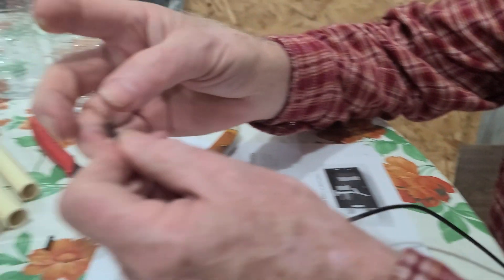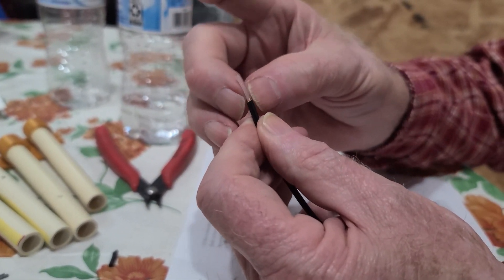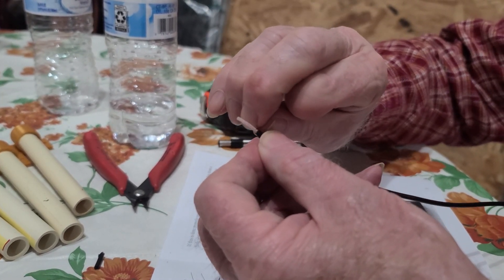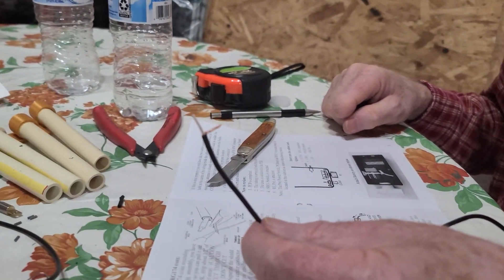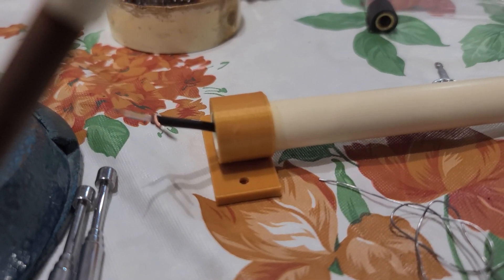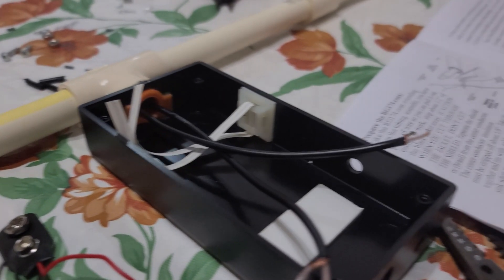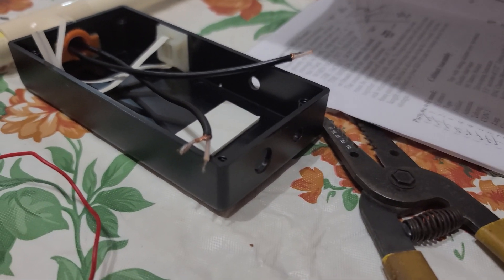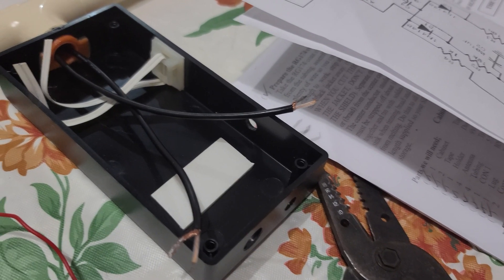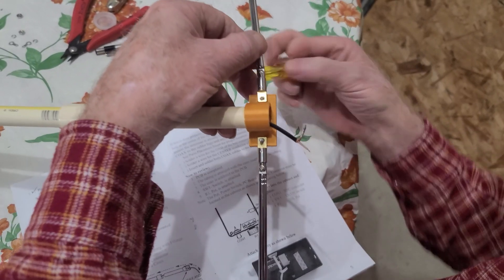In this segment, AC4DM — Don, our club president — is working on some of the fine coax cable. It's coax, just very thin and fine. He trimmed off a little piece and is getting the braid twisted together and the center conductor separated. You're going to run this through the slip-joint PVC pipes — no glue required — connected to the box that serves as the T in the center. You run some of that fine coax to each end for the antennas, and the other ends go into the center of the box. The shielding is separated from the center conductor, ready to make those connections later in the build.